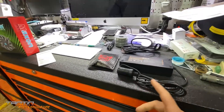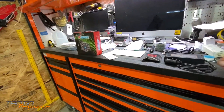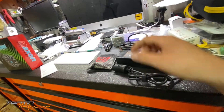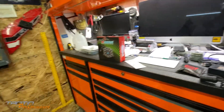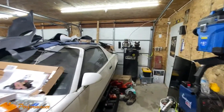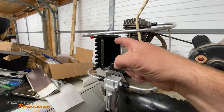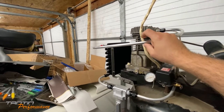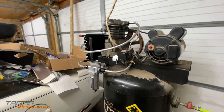I didn't run it for a continuously long period yet - I'm going to plug it in and let it run to see how hot this gets. I'm going to put a 10-amp fuse in between the converter and the fan. We're going to get rid of the plug-in and go to a direct connection of some sort, then wire it into the leg on the compressor so when the compressor kicks on it kicks the fan on. I can get that mounted to the after cooler, then get my nut put on and the line flared tonight.